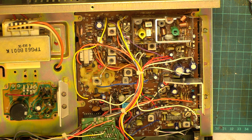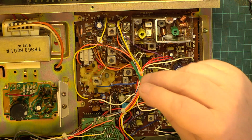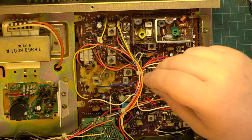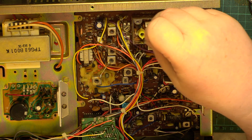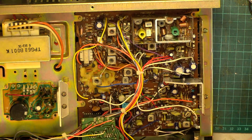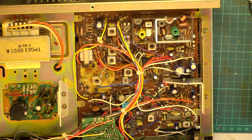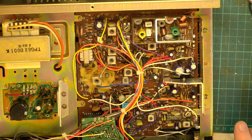At least, unless the power supplies go up the spout and suddenly pass 26 volts into the electronics, unlike a car, all your other capacitors have been looked after by the power supply, because these are never set high unless they go wrong. Whereas in a car you can end up with dodgy alternators pushing out 15 volts, and end up with the Wally who put it in a lorry and blew the set up. So there's a lot of things which can't happen with a base station.